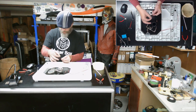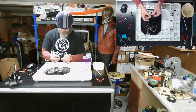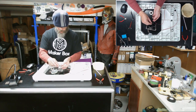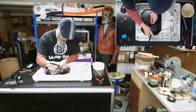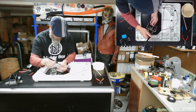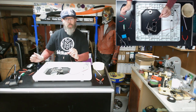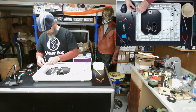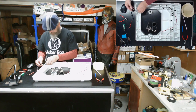All four wires are tinned. Now I'm going to slide a couple pieces of heat shrink over the ends of the wires and then connect each of our wires — the connectors to the wire. Now we're ready to insert our switch. Feed the wires through before you put it in.